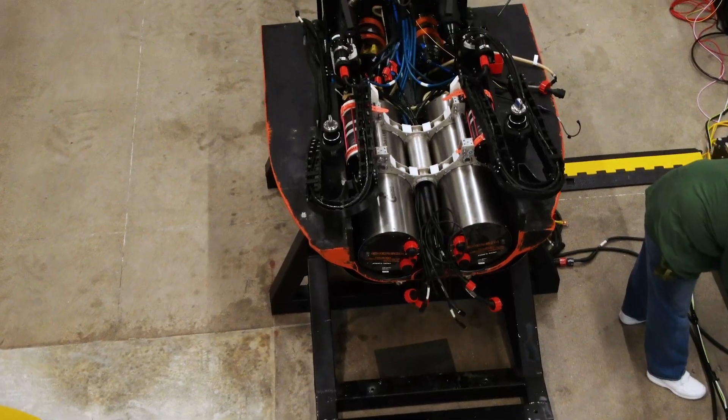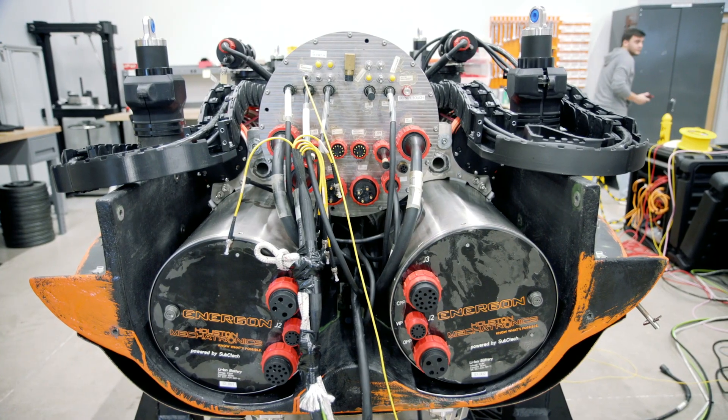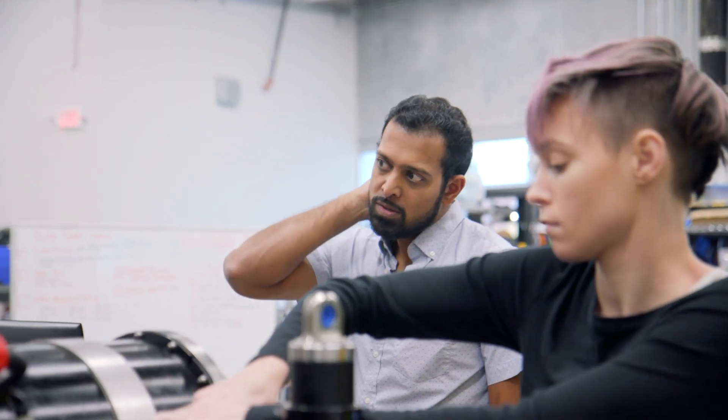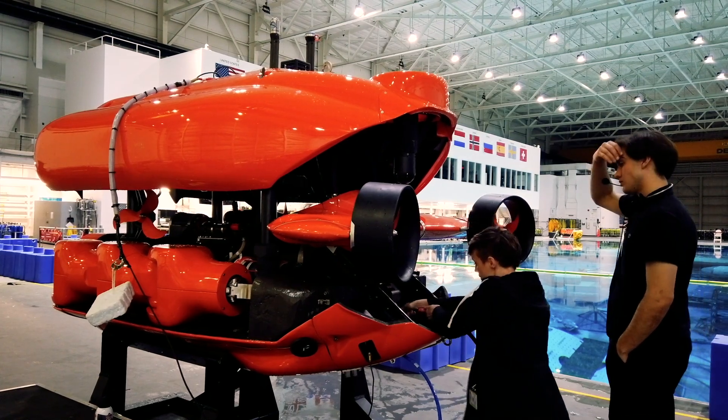Our main power electronics housing, called Cybertron, had a lot of cabling — it is the nexus of the vehicle. To make it robust, we want to reduce the amount of cables: less wires, less interconnections — the more robust something is going to be, and the easier and cheaper to build. We made a backplane to reduce and simplify the cabling and routing inside the housing. Our vision is to eventually have a fleet of Aquanauts — it's just a matter of time now.